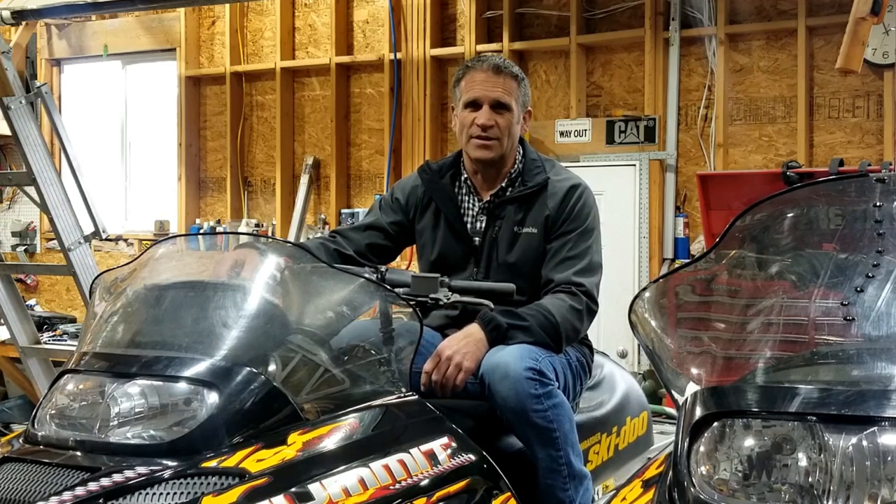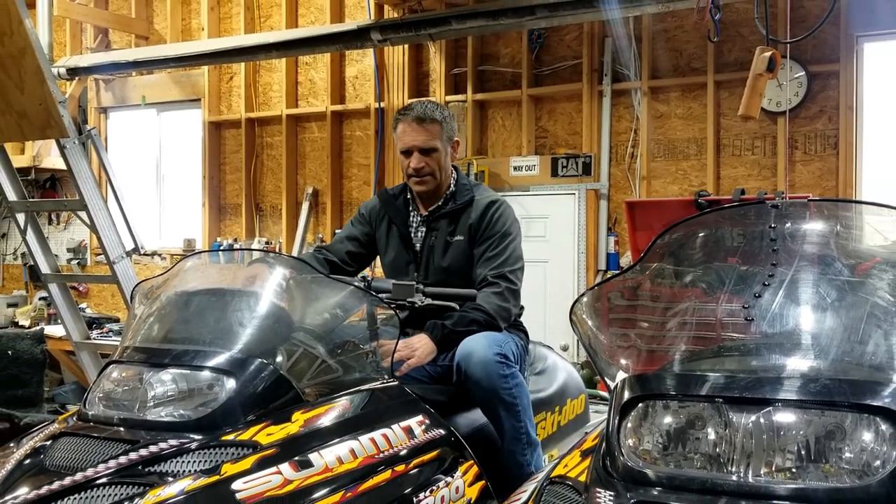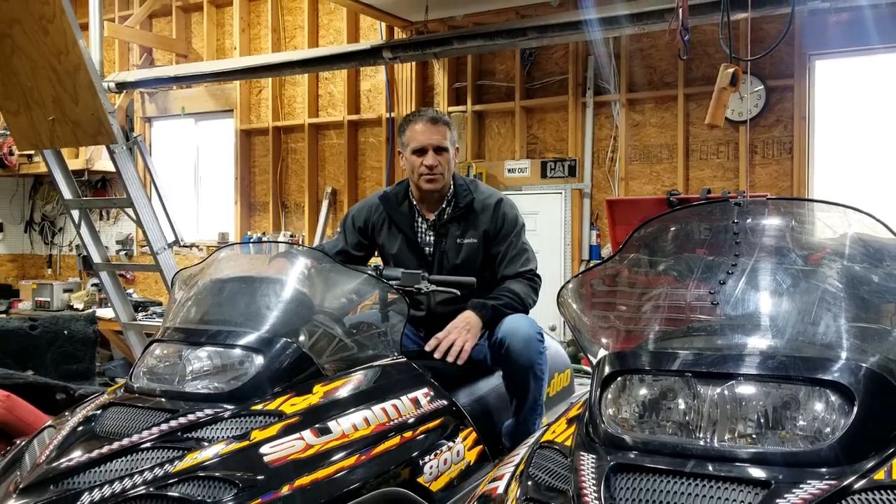These machines were carbureted back in the day. Is that the likely problem? Usually it is — that's my default position. But once the machine starts it keeps running and it runs okay. The further complication though is once it gets hot it's probably not going to start again, even with ether it can be difficult to start. Now that's according to Jerry — I haven't had them out firsthand. But that changes the dynamic of the problem just a little bit.